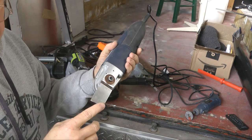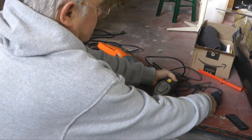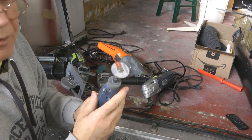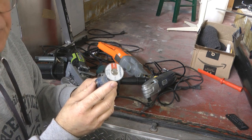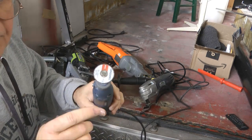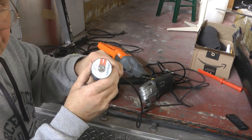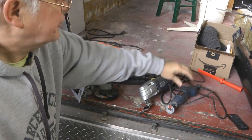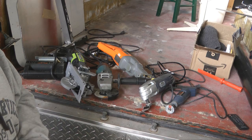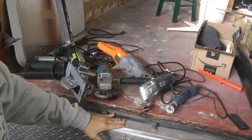There's lots of very exotic blades at your builder supply store that will cut through just about anything — pretty amazing. And then don't forget another version of a cut-off tool: the Dremel type with the small disc. This is good for cutting very small pieces off, similar to our multi-tool, and also for making non-straight cuts into metal — with a steady hand you can make curves and other angles. Between all of these tools, I have not hit a challenge I wasn't able to tackle when it comes to cutting metal. Now let's go take a look at some of the construction progress on the ambulance as far as cutting openings.